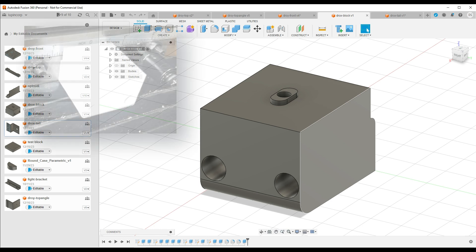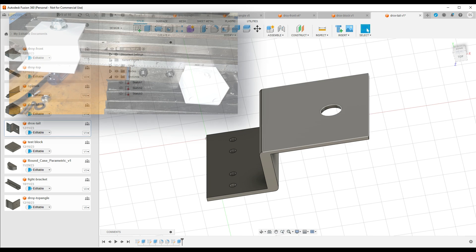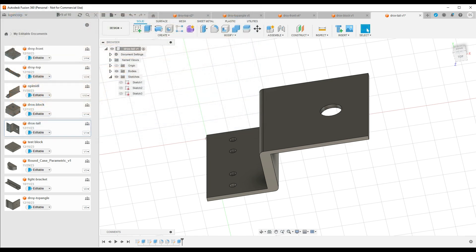The x-axis block fits into the front of the DRO using some existing four millimeter holes in the bed of the mill. A tail piece fits onto the end of the DRO and connects to one of the T-bolts on the bed. The idea with all of this was to use only existing holes - no drilling into the mill - and to make it easily attachable and detachable by just unscrewing some bolts. Because the DRO is only six inches long, using the bolt in the T-slots lets me move it around to get within that six-inch range of movement, which works for most things I'm doing.